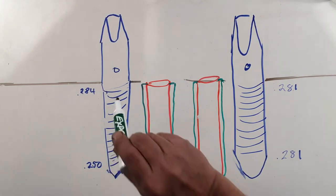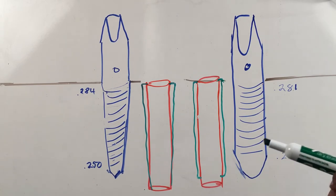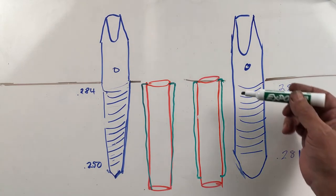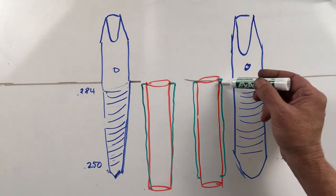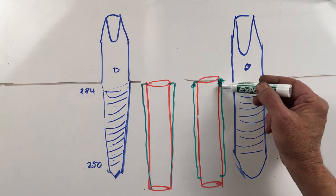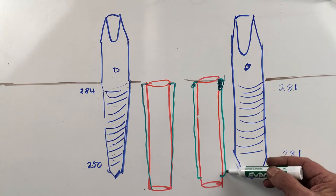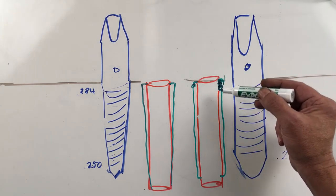It was with great difficulty that I got this pin into this hole to any depth. Much less work than driving this pin. And the torque went way above anything I would need far before I got it to any depth that would have been useful. So something else was going on. And what it came down to in my mind was that as you drive this straight-sided pin in, it smashes this much wood to the side. And then the next one smashes this much wood to the side, and things just slide by from there on. And on the way down, it's basically a repeat of the same thing. Push some wood to the side, and the rest just slides by.